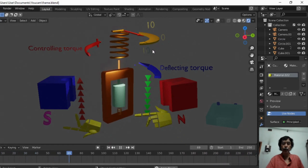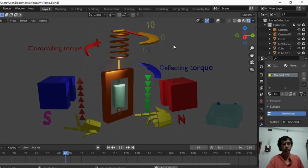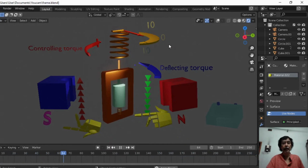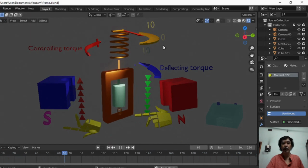We have not used any unit in this section because we are not interested in the amount of current. We are only interested in whether there is current in the circuit or not. It only senses the existence of current. If a low resistance is connected in parallel with this circuit, it will be converted into an ammeter or milliammeter. Then, if a known current of say 10 milliampere is passed and the deflection is at mark 10, then it is 10 milliampere.